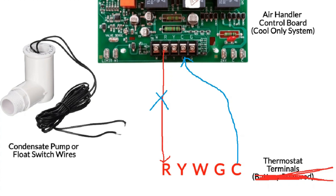What this would look like is: we take the wire coming off of our Y terminal on the thermostat, and instead of going straight into the control board, we run it through the float switch, come back out, and then go to the control board. So what we're doing here is keeping our charging circuit intact for the smart thermostat, so we're not killing the power on a high water situation, but we're not allowing the thermostat to activate cooling mode to generate more water.